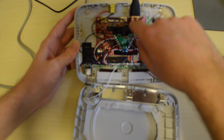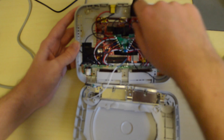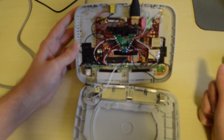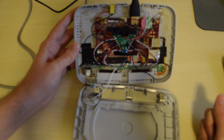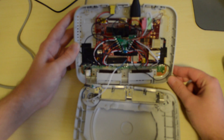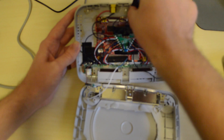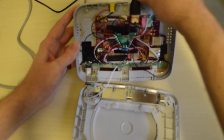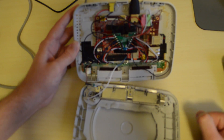And then I hardwired the PS1 USB adapter in here - that's why I detached that connector. Just because if I had left the USB slot, it wouldn't actually fit here. There's not enough room to plug a full thing in there. And then it just has HDMI out on the back. I'd like to figure out some way to make this HDMI jack flush here on the back, but HDMI has like 30 or 20 wires and it's just kind of a headache to try to manually hand solder that. So I just kind of leave this HDMI jack plugged in at all times. It's not the best solution, but I guess it gets the job done.